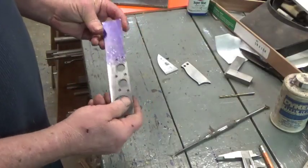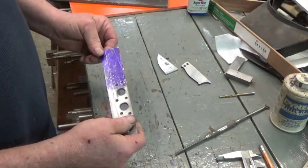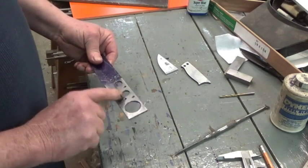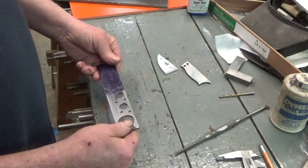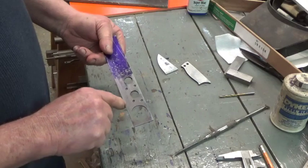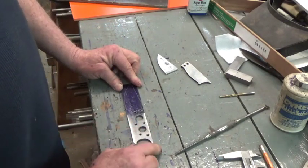The next step is getting rid of all the extra steel that isn't knife. The lion's share will happen over on my little vertical metal-cutting band saw, and then we'll profile down on the grinder. After drilling and countersinking, I got the burrs out of the way so everything still lays flat on the drill press. It kissed some of the bluing away, but no big deal — the deep scribe is still visible all the way around. That'll guide me as I cut out and profile.